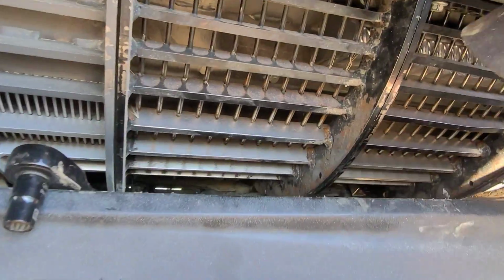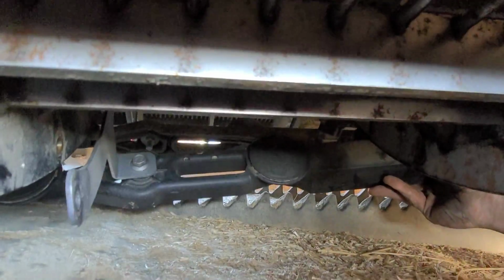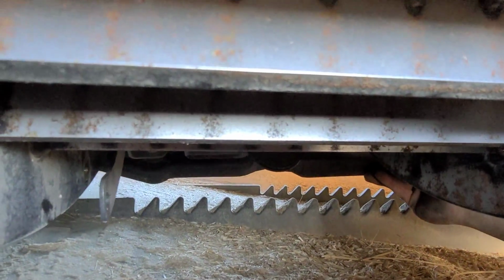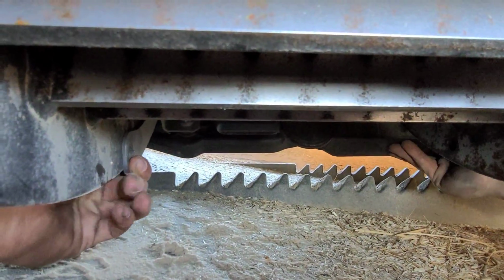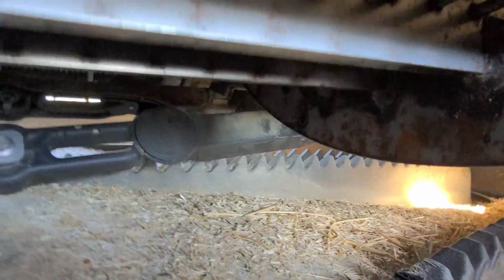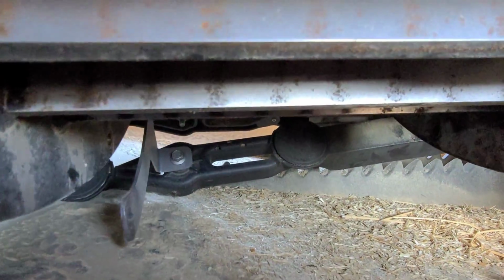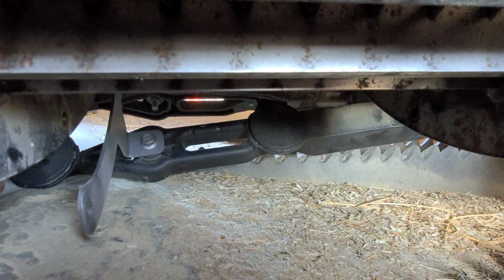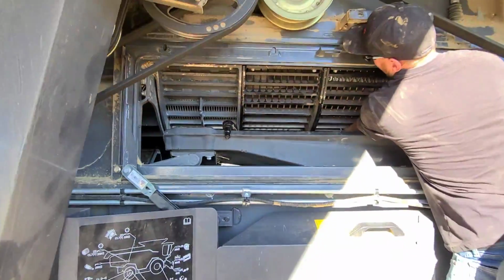And just when you think you're done, you've got this sensor bar under here. It's actually a MADS 23. How do I know? Because it's quite faulty sometimes, and it's for the automation, I think. You've got to bolt this in like that. And there's one on each side, obviously. It's for grain loss. It just reads the grain that hits it. That's how it knows how it's loading itself, or is supposed to.